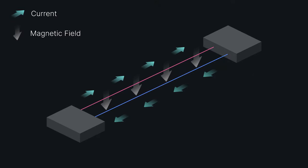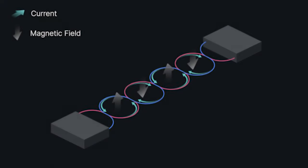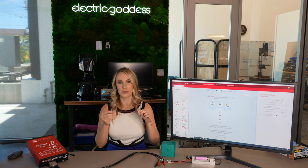This is because in the space between two wires carrying current in opposite directions, the magnetic field compounds — it's additive. Twisting it reduces the magnetic field to zero. Higher current produces an even higher magnetic field, so it's important when using high currents to do something like this. There's other benefits to this too, and I've provided a resource in the description below if you'd like to read more.